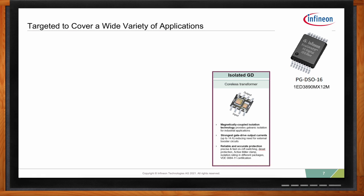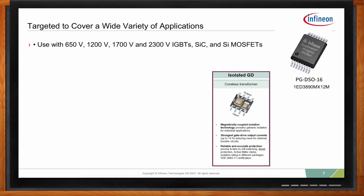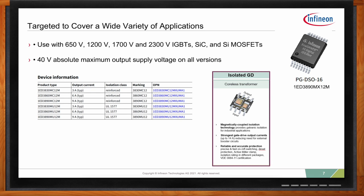This part works with a lot of different applications. It has 2300-volt isolation, so you can use it with 650V, 1200V, and 1700V switches that require 2300V isolation. You're not paying a premium for that — we use coreless transformer isolation, which inherently provides fast input-to-output response and excellent isolation. We also offer a 40V maximum on the power supply, so transients or shared supply rails up to 40V are handled.